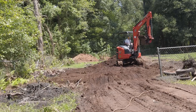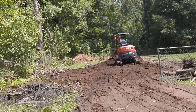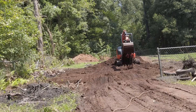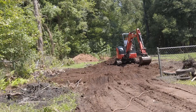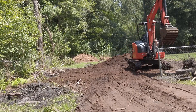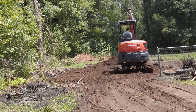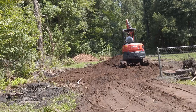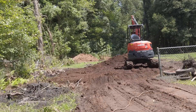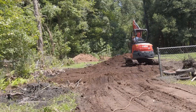To compact this properly, instead of putting 18 inches all at once and then trying to compact that, what I would do is just put one bucket - that would give me about three or four inches of material after I packed it down. Then I would just do that over and over again. I think I took about four or five passes like that, and then I would just start running the machine back and forth in order to get that compaction down. I didn't rent a plate compactor - I just figured I would drive over it.